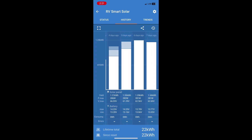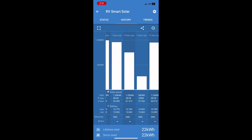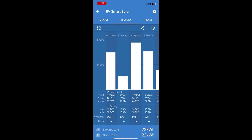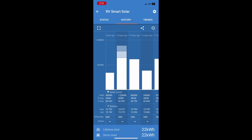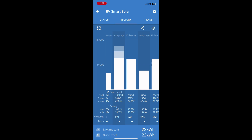Unfortunately, we're getting so much rain here in East Tennessee that I'm rarely getting enough sun to fully charge up my batteries given the amount of usage I'm doing. I'm basically using more power than my panels can create in that shaded location. So ultimately, I'm probably going to have to put those panels somewhere they can be sunny all the time, delivering 20 amps to the batteries consistently. Then in this chart I should see absorption mode and eventually float mode when the batteries are fully charged. It is possible with those panels — you can see it happening — it just doesn't happen enough.